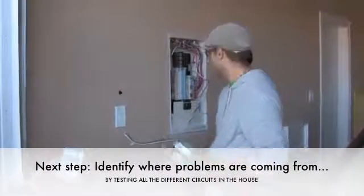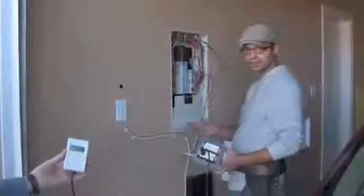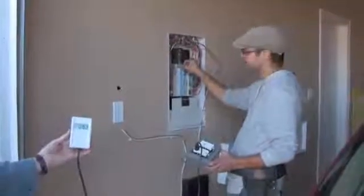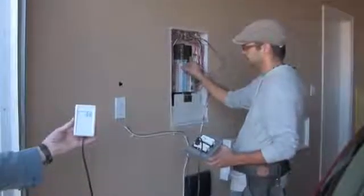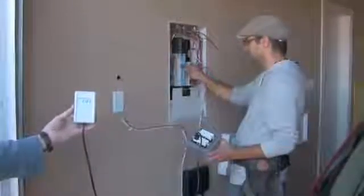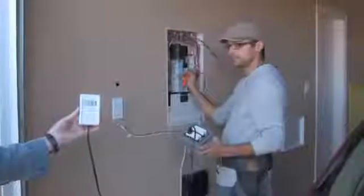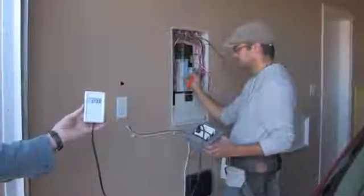So what we've done here is isolated the entire house, and we're going to turn on one breaker at a time and see what kind of effect it has on the overall GS units put onto the house and on that individual circuit. So turning on that one does... Still at 100. 100. 170. Drop down to 135, 188. 267, 300. Okay, so that one's a high one. Which one is that? I'll look at the schedule afterwards and determine, gotcha. But I'm going to put a mark here on that breaker to do. Yeah, that's running right at 325. Jump to 490, down to 135. 98.